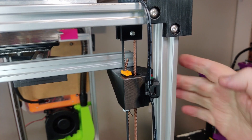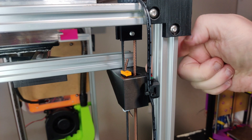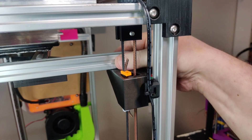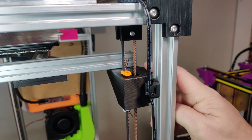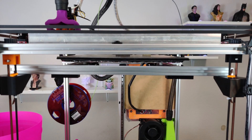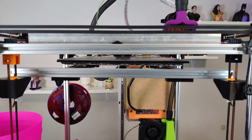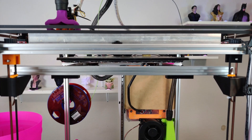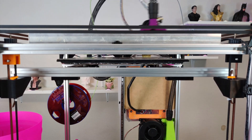This is the simplified bed holder. There's a rail on the inside bolted to a printed part, which is bolted to the extrusion — nothing fancy. The plastic itself bends a little bit, so this is printed in ABS, which gives enough flexibility to do triple-Z gantry leveling, or Z-tilt. And because it's kind of permanently mounted, it doesn't really go out of tilt that much.